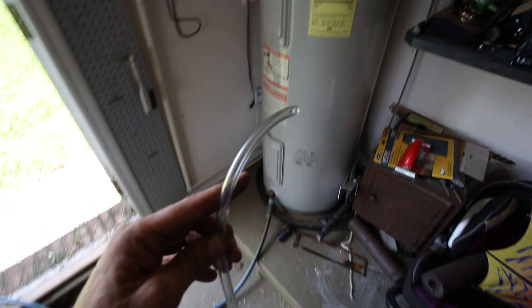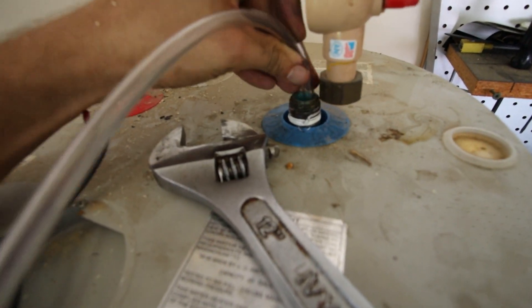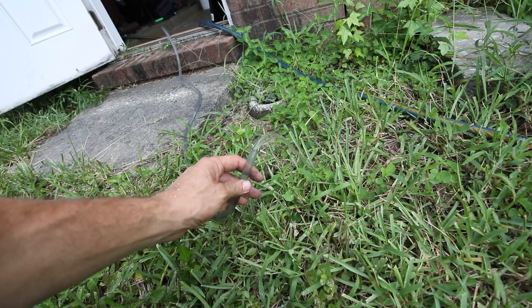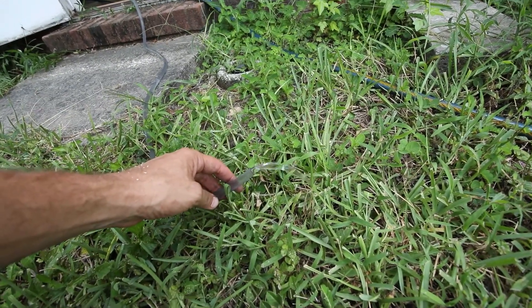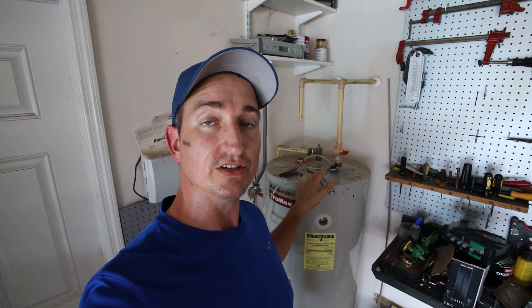What I'm going to do is snake this skinny hose down into the water heater to start a siphon — there it goes. I basically filled this hose with water, dropped it down in the tank, and got a siphon going. It's still not a lot of water coming out fast, so I'm going to let it sit. I've got the siphon and the trickle drip going out the bottom, but it's going to take at least an hour or longer for this to drain enough to move the old tank.